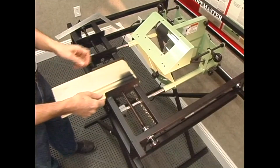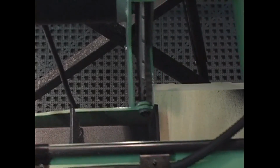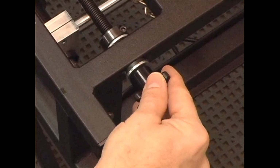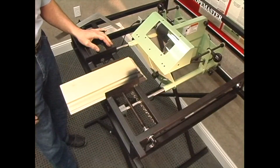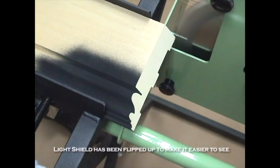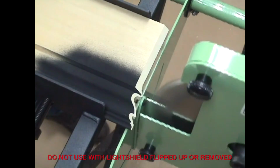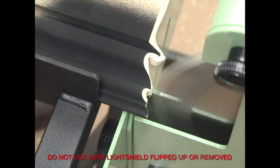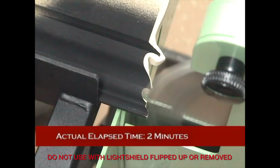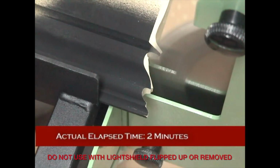Place the template stock in the vise in front of the saw blade, about 1 inch or less in front of the edge of the vise to the deepest part of the bevel cut. Pull up on the movable vise jaw and push down on the workpiece as you tighten the vise. Once the jaws make contact, tighten just a 1/4 turn more. With the piece secured, you can begin the cut. Turn on the light and make sure the blade is free from contacting the wood, and then start the motor. After hogging out most of the material to within about 1/16 of an inch of the black line, use the magnifying headset and remove the wood up to the black line. It is important to do this as accurately as possible. It takes more patience than skill. The better your template, the easier it will be to produce perfect copes every time.